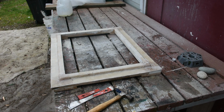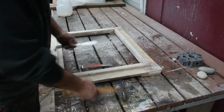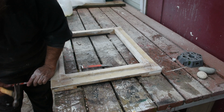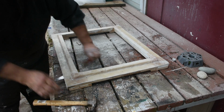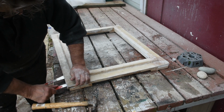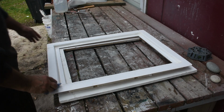a couple of flat glazing bars, we call them. They're actually beekeeper's bar for taking out the honey and honeycombs out of beehives. But they work good, they're nice and flat. And there we go, we popped it all out, and there's the framework. And now we'll just get that wipe off, get any of the paint that's stuck to it, or any of the filler.